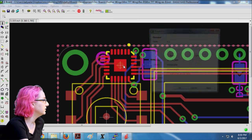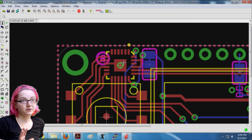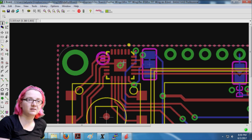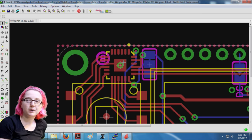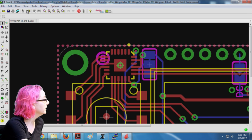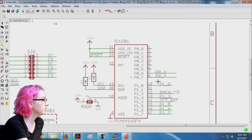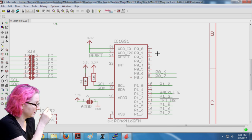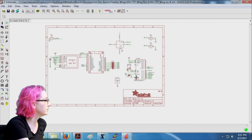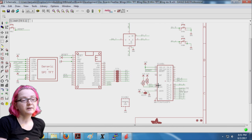I also put the backlight and the TFT reset on the GPIO Expander. I found a pretty good one on DigiKey — it's the PCA6416. What I liked about it is it's pretty cheap, only about 50 cents. It's very small, QFN, which I like. QFN is actually in my opinion the easiest pick-and-place component. TQFPs have leads that can get bent; I've almost never had a problem with QFNs, especially 0.5mm pitch ones.